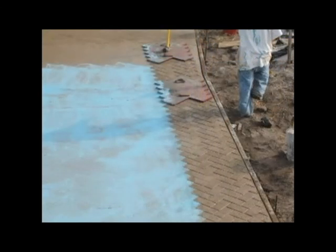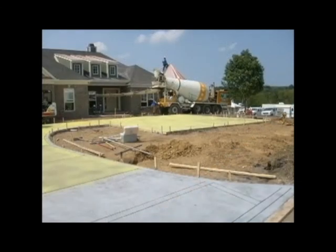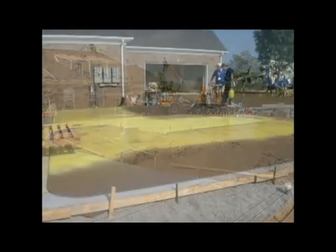TopCast is typically dried to the touch in 20 to 45 minutes, yet at times, depending on weather conditions, may take up to two hours. Once dry, the dried surface will protect against light rain, thereby eliminating the need for plastic cover protection.